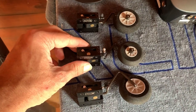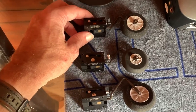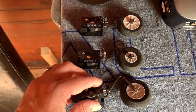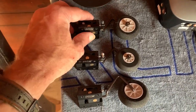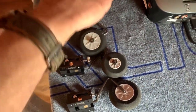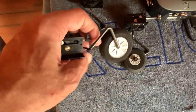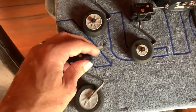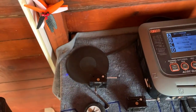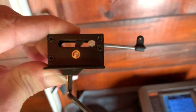When you get your retracts, two of these are at 90 degrees and one is at 95 degrees. You need to make sure the 95-degree retract is mounted in the nose. How do you tell? Well, very simply — especially if you've lost the label as I have — extend it out so it's fully locked. Then simply look at the bar. That's definitely 90 degrees. That's definitely 90 degrees. That one is 95 degrees, and this is the one you want to mount in the nose.